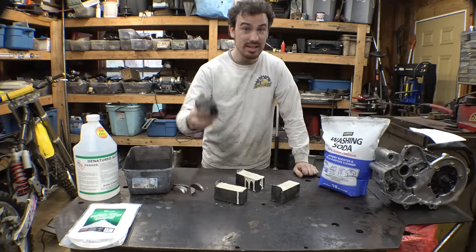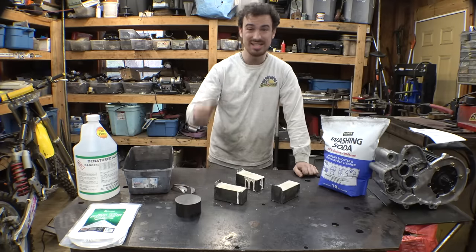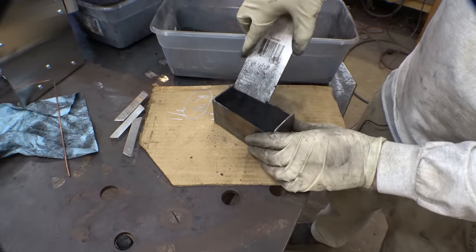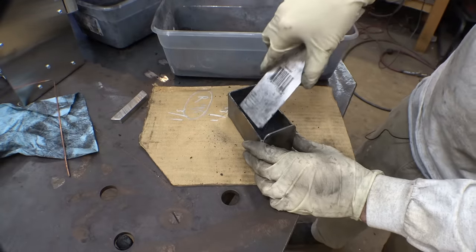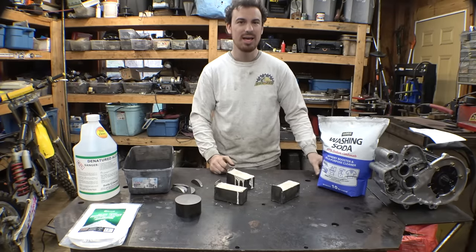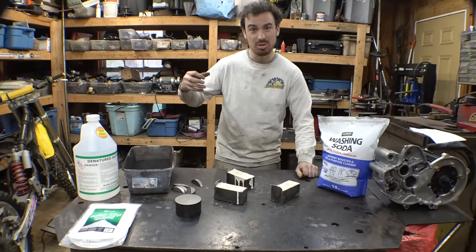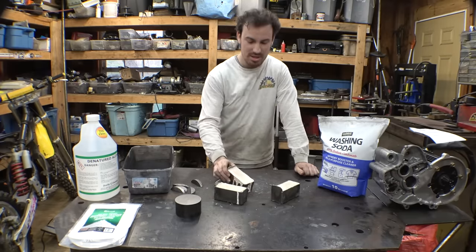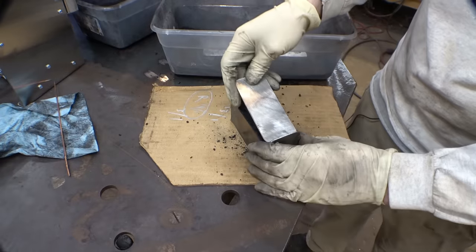This is what's left of the steel chunk I used. I cut that chunk into slices, cut those slices into strips, and yesterday put 3 strips each into these steel containers, then filled them up with charcoal. This is sodium carbonate. I mixed 5% by weight into the charcoal so that the charcoal can heat up and not burn off. Then I sealed these containers off using refractory concrete.